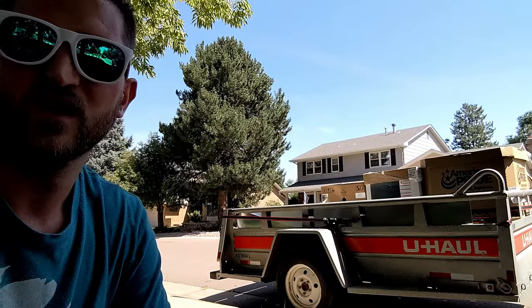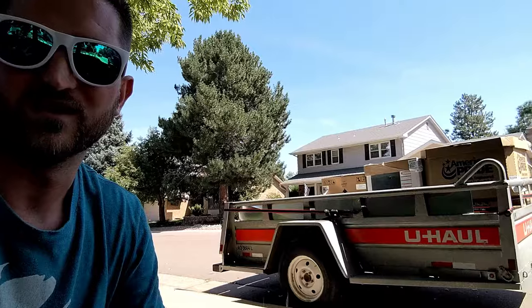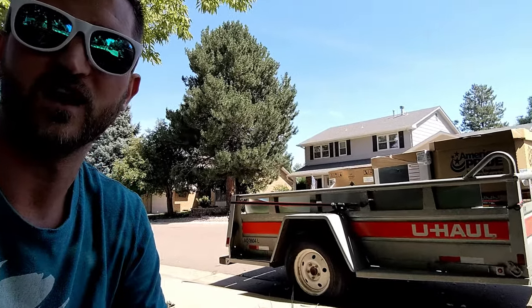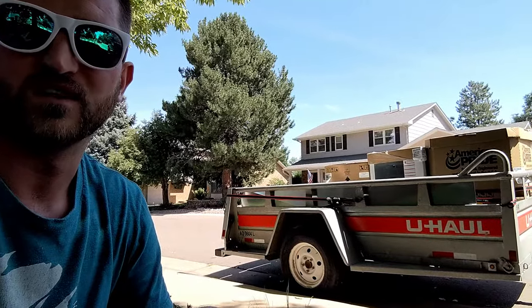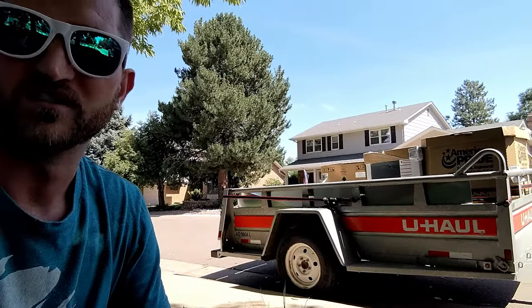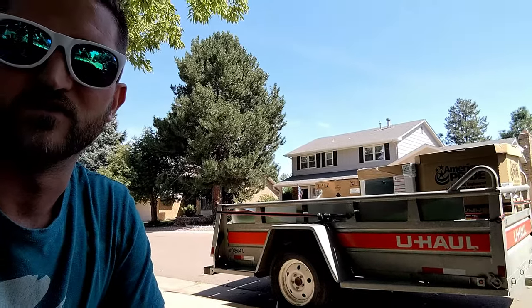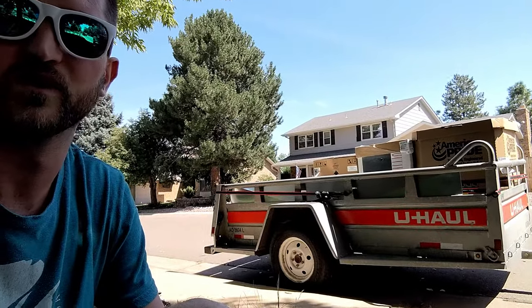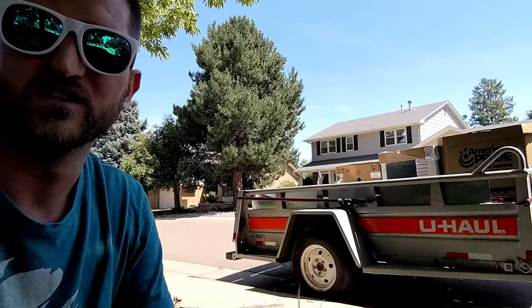So if it's too big, your house is going to heat up and cool down way too fast, and it's not going to be a nice even temperature. Plus those motors are going to be cycling on and off, on and off, on and off as it cools down the house really fast. Versus what you really want is something to kick on and run and circulate that air and then shut off and just cycle a few times every hour, which really extends the life and uses the equipment the way it's supposed to be used.